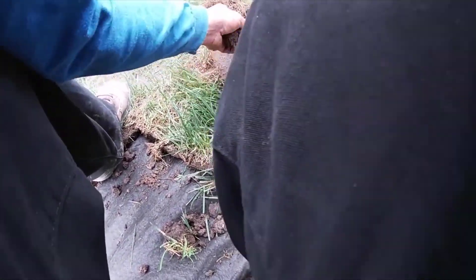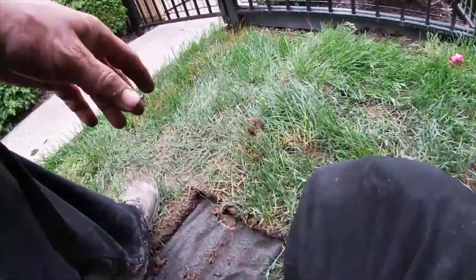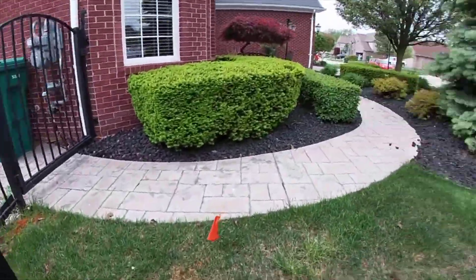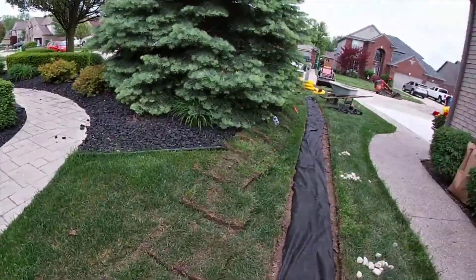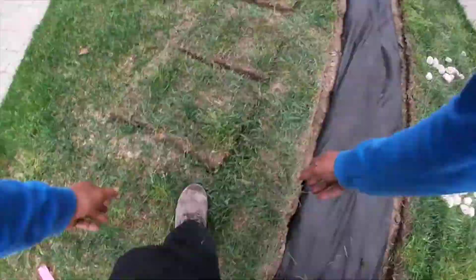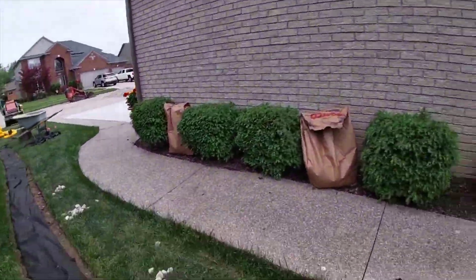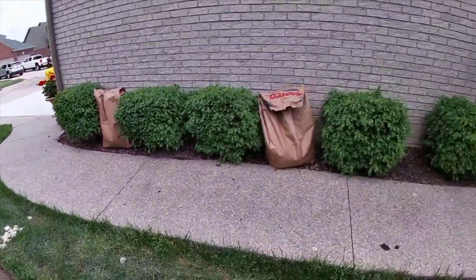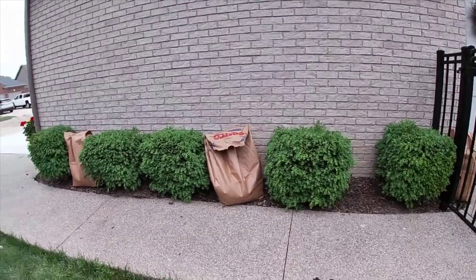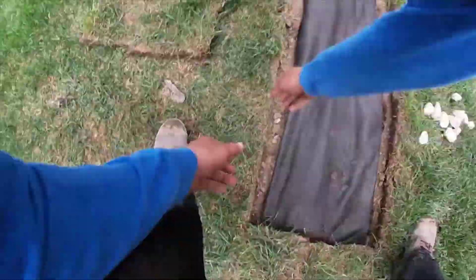Then he went back and cut off all the excess. The overlap should be minimal — just an inch or two, no more. The more overlap you have, the more you'll slow down your French drain system. All those little holes punched in our fabric allow water to flow right through into the stone of the French drain system and then down to the pipe.